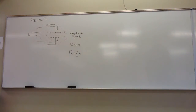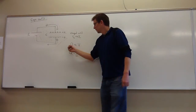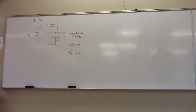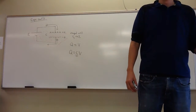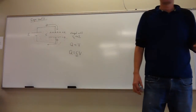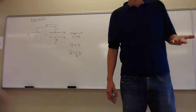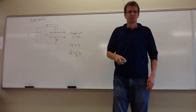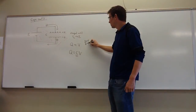The amount of charge we can get on each plate is proportional to the charging voltage. For instance, attaching a capacitor to a 1,000 volt battery will put more charge on the plates than connecting it to a 2 volt battery — you don't need that much charge before the voltage difference reaches 2 volts. So if you double the charging voltage, you'll double the amount of charge on each plate.